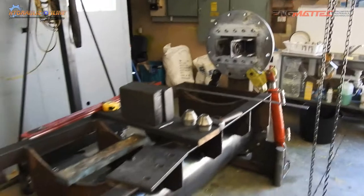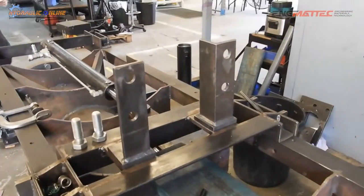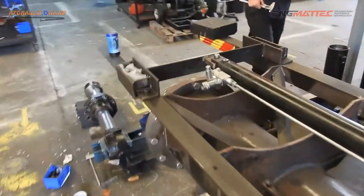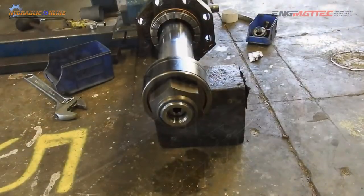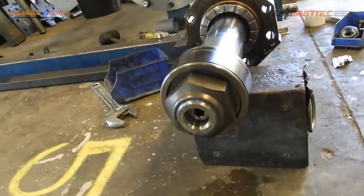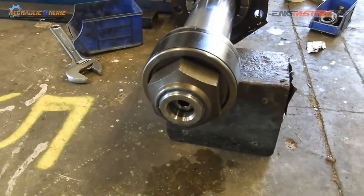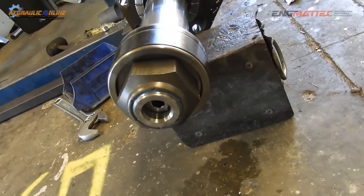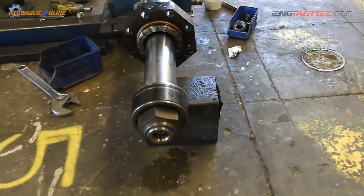So that we can bolt the plate into there so we can break out the nuts. Those nuts are done up extremely tight. So we'll go over to the welding bay and mark out the plate. We've also got another larger hex nut here, a big nut holding the piston on. This one's approximately 100 millimeters across the flats, and across the diagonal is 115 millimeters. So we'll show you what we did.